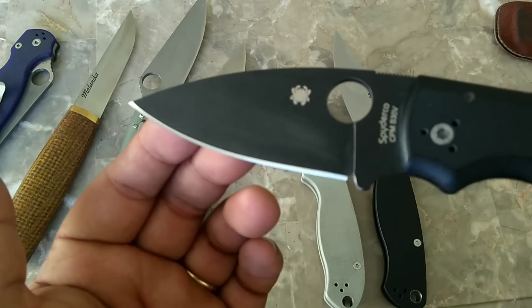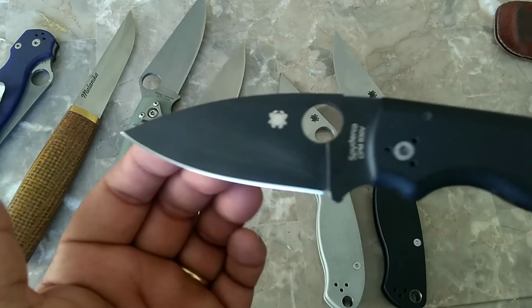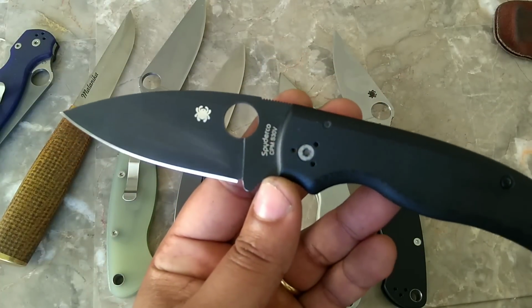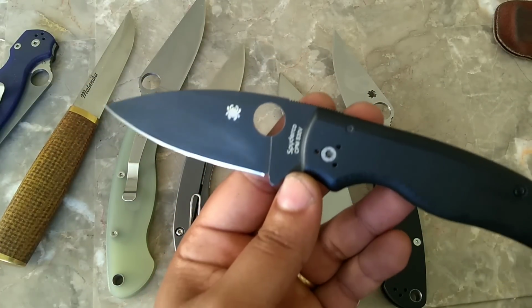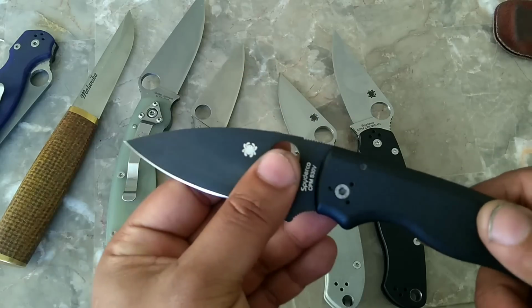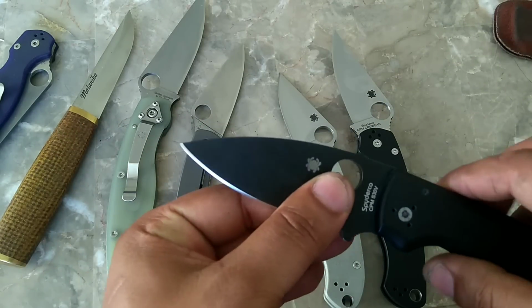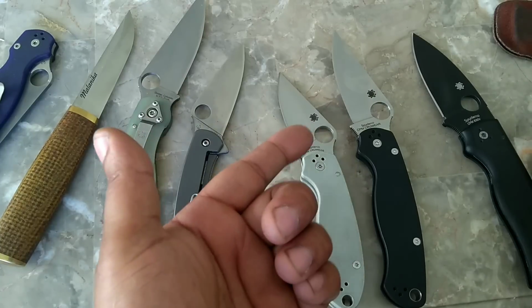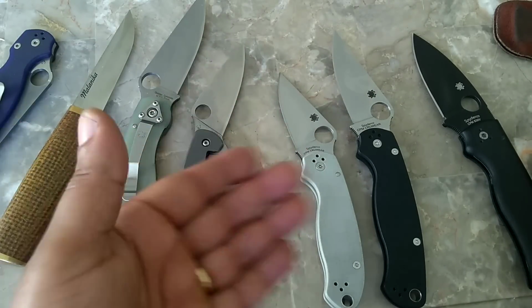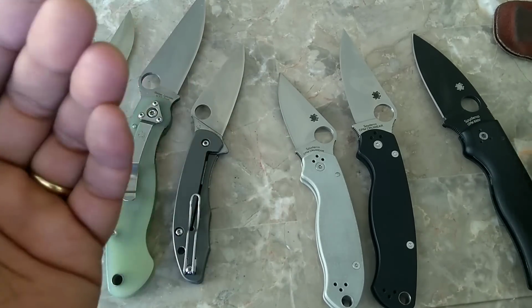And trust me, I always polish my S30V because I like to just do it, and I like to sharpen all the time. But this steel would do a lot better with like a 600 grit, 400 grit edge, and then stropped from there versus polishing it out to 800 to 1000 grit. Man, you're really kind of losing a lot of the ability of S30V. It's a more aggressive steel. So while it may have more cutting endurance than Cruwear, there's a lot of benefits to Cruwear. It takes a better edge, it sharpens better, it's tougher. It seems like it has better polished edge performance. And so that's why Cruwear is king, as well as the fact that it's tougher.